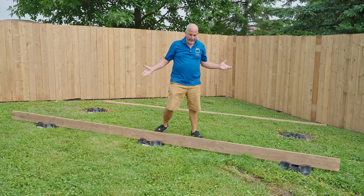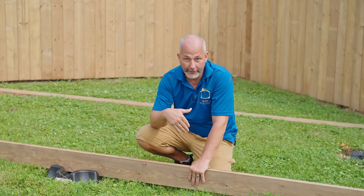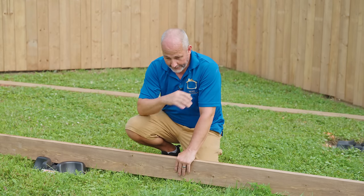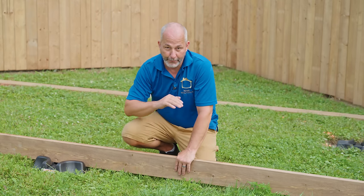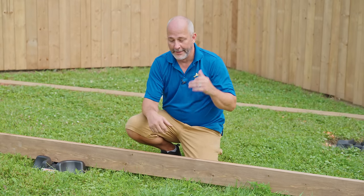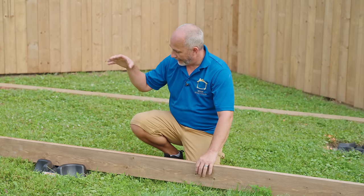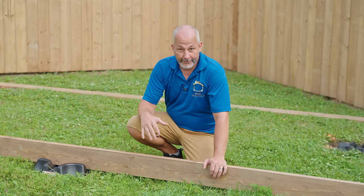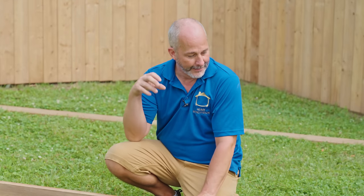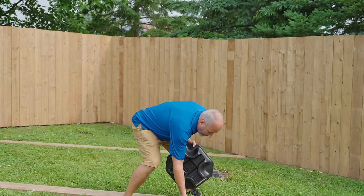This requires your surface to be flat before you can do this, but if you do a stone pad it works really great. One of the advantages of using a product like this is you're separating your wood structure from the ground so there's no wicking of moisture — everything you're doing is about building science. Because this is a heavy duty plastic it breaks that moisture barrier. The only moisture that's left is in the atmosphere, and buildings will dry out as long as you're not in contact with the ground. You need at least three blocks on each joist if you want to go ground level. That's a demonstration of the flexibility of this product.